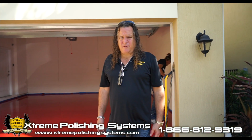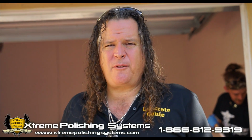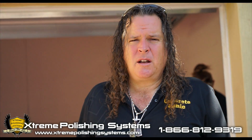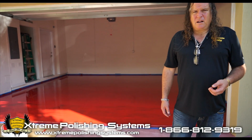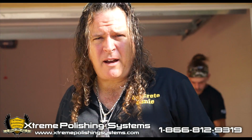Floor here for today. Jeff's just finishing up the last few rolls. Tomorrow we're gonna come back, we're gonna apply the gold glitter into the clear. We're gonna apply it at 50 square feet per gallon, okay? So it's 450 square feet. We're gonna have 3 kits with us tomorrow. It's gonna take 9 gallons of product, and it's gonna take about the same amount of glitter, 9 pounds of glitter. So enjoy the rest of your day, and we'll see you back here tomorrow.